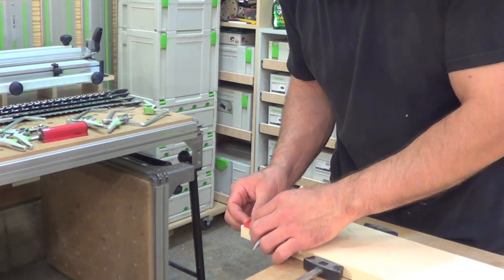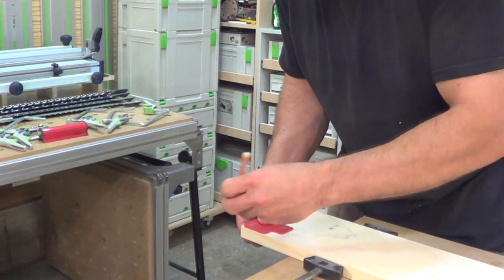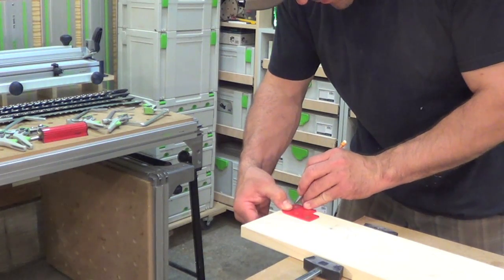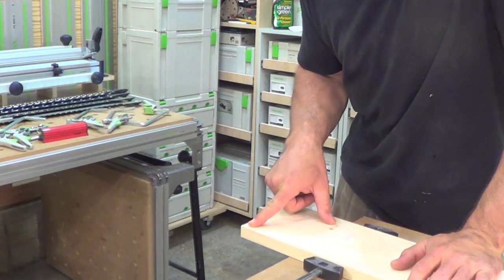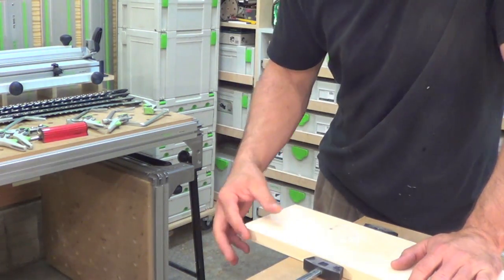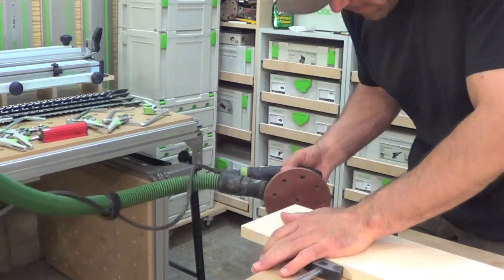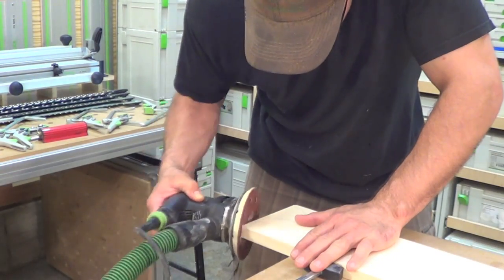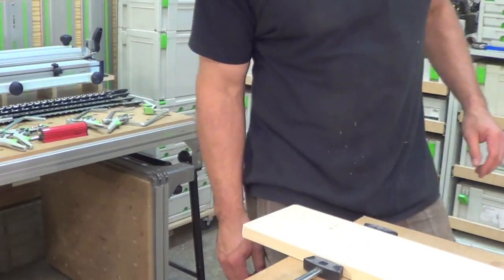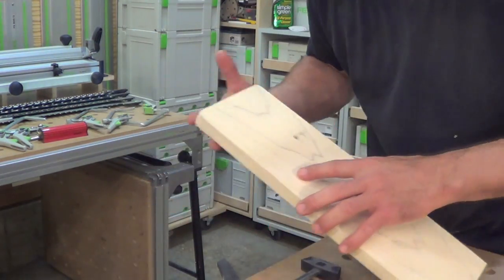All you have to do is come over here and make sure that the front and the sides are flush with the shim and the board, and mark your radius. Flip it over and do the same on the other side. You can see here already that by me using the tape measure, I wasn't even close to being what would be pleasant on the eyes of 10 millimeters. So you just take a sander now, and just like that, my board on the edge, nice and softened, right up to my lines, ready to go.